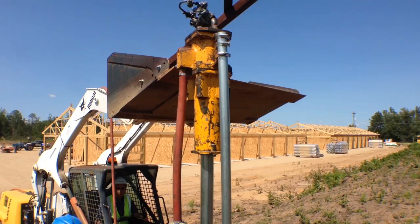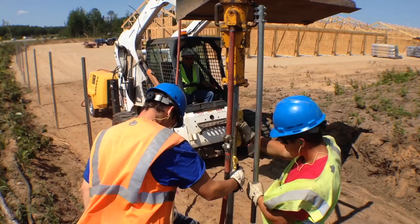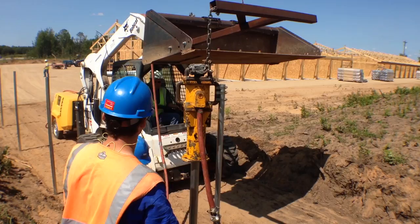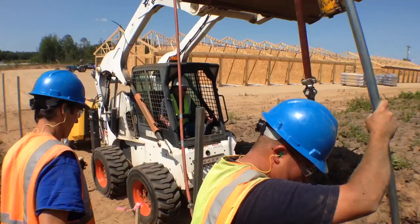On airport jobs where we're doing taller posts — we have 15-footers that we pound in five feet in the ground — we typically use the tractor. We can get it up a little higher and see it a little better instead of the bobcat. Also, using the tractor bucket we can use the PD140, which is a lot heavier, and we don't want to carry that up a ladder or put it on a scissors lift. The tractor or bobcat with their boom lifting it up and down makes common sense and makes things much easier.